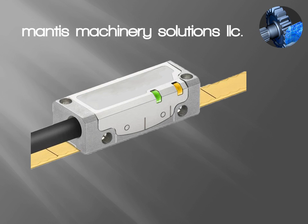This is a picture of an encoder. There are two major components to an encoder: one of them is the read head, pictured here, and the other is the scale. The read head travels along with the axis and the scale is stationary — probably bolted to the side of the machine or runs along a rail — but the read head is moving relative to the scale.